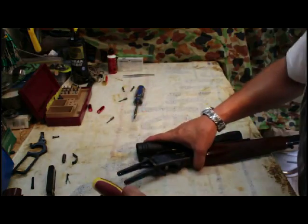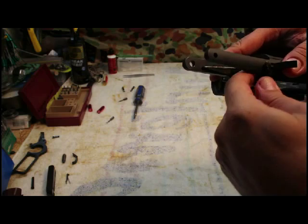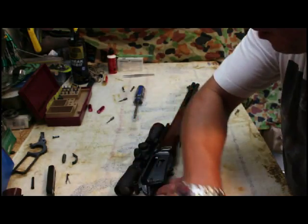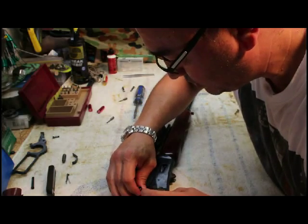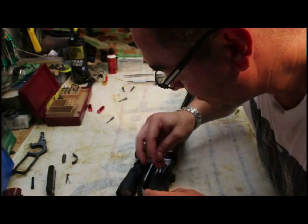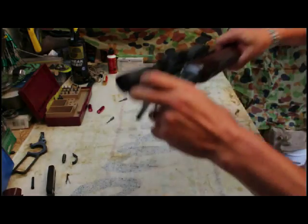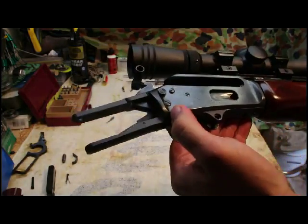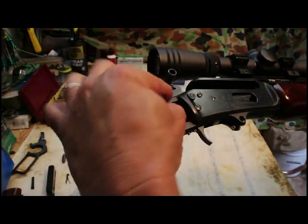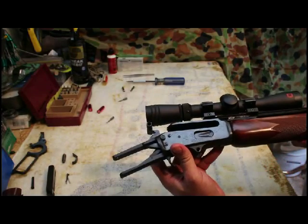Make sure that doesn't move. If it's all in place, the hammer pivot screw should just drop in — it's a little bit tricky, this would be the trickiest part of the whole operation. With practice you should be able to get it, it'll be a lot easier the next time. The first time I did it I thought I'd done something completely wrong. So if this is lined up properly the screw will just pop in once the tension is taken up.